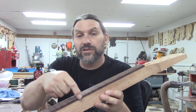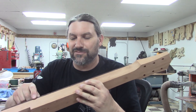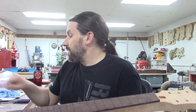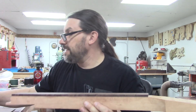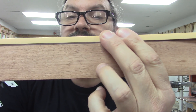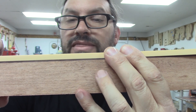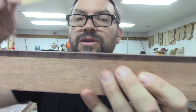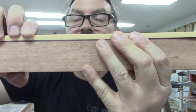I thought it would be neat to put some binding on here. What happened was my fretboard chipped, so binding is a good way to fix little dings in the fretboard — you just cut the dings off and backfill with some plastic. Something we like to do is leave a little piece of the fretboard wood showing, so there's the fretboard and then you put the binding on it and push it all the way down, and you can still see some of the fretboard.